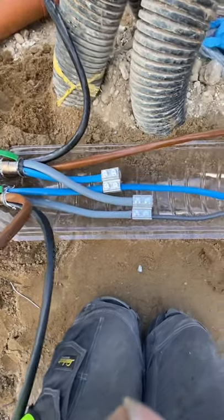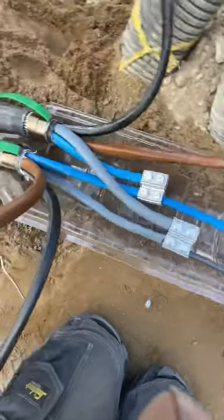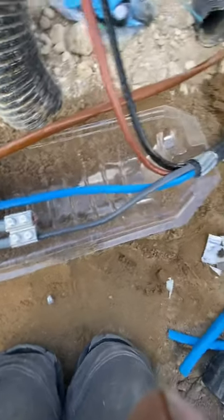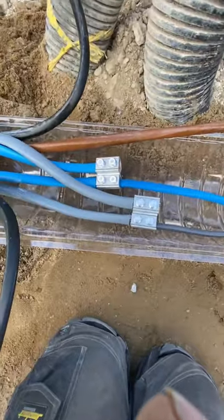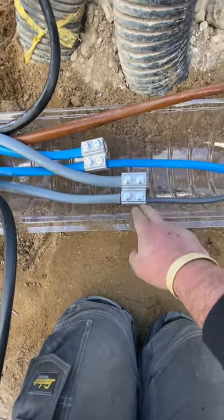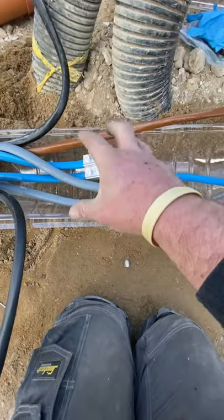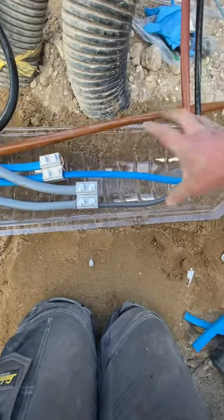Alright, so there's two in. That's a 70mm by the way, so it's two 185s in and one 70mm going out — it goes there. So I'm going to tape those up now, and then I'll have to take that away because I can't get the tapes underneath. Take that out, tape them up and then the other ones will come across the top in sort of this area here.